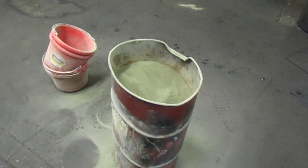There's our sand bucket — our knuckle is about halfway down in that barrel. We took the knuckle up till we just started seeing red over the majority of the surface.